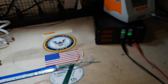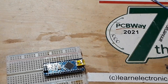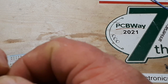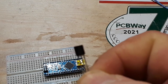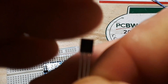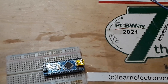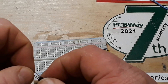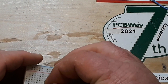Let's get it set up. I'll take a little breadboard here with an Arduino Nano on it. And we're going to need transistors, because you've got to remember the maximum current on any pin in the Arduino is 20 milliamps, and these are 22 to 25 milliamps minimum. Yeah, that's not going to work. Anyway, these are 2N3904s — simple NPN transistors — and we are going to need three of them.